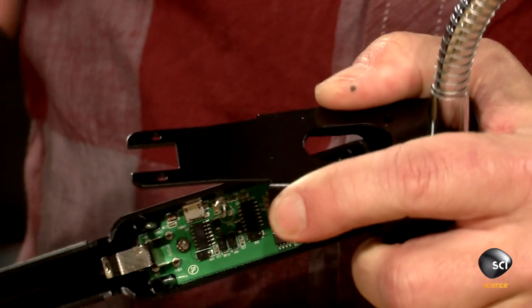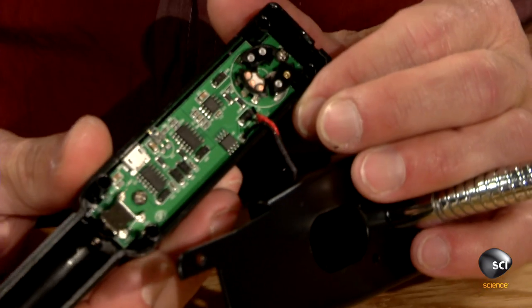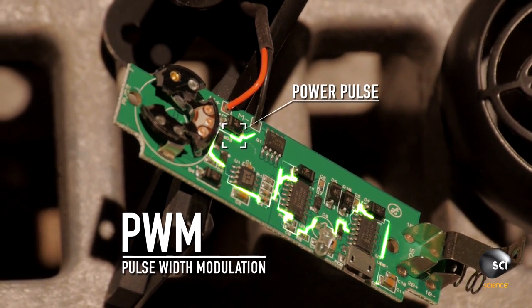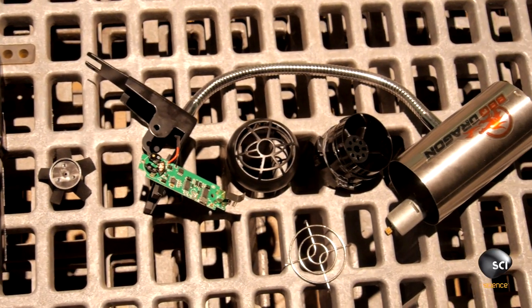I think if we tear it apart, I'll kind of see the quality of the parts and stuff. So we're going to dig in. This is a PWM — Pulse Width Modulation. In order to adjust the speed of that motor, they're pulsing the power on and off. It's the amount of time they turn the power on and then turn it back off again, and at the rate they do that, they can actually adjust the speed of the motor.